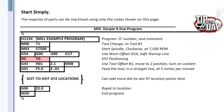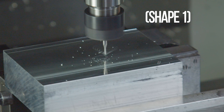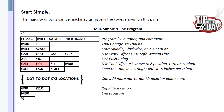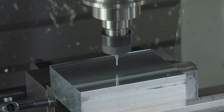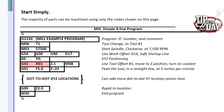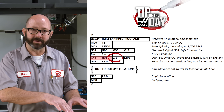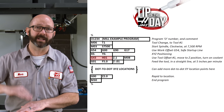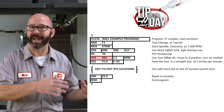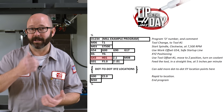Here we have our X, Y starting position — it's where our tool will go first, like the first X, Y position of our first shape drawn on graphing paper. G43, H1: these codes work together to let the machine know where our tool is in relationship to our machine and our part in the Z axis. We usually use H1 if we're using tool one — they typically match. H1 references row one on the tool offset page. We've also got a Z move on this line — this is the very first Z move of the program. You never, ever want to command a Z move unless you've commanded a G43 H-something that matches your tool number beforehand. Otherwise the control doesn't know where that tool is in space.